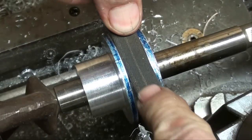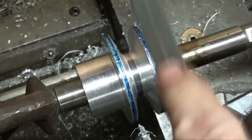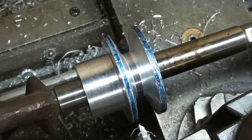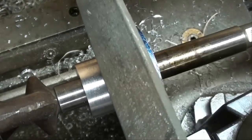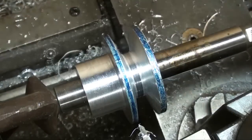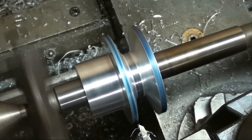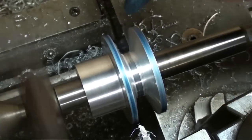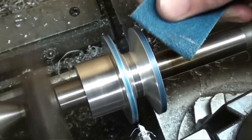It looks like we're right about at a half inch — remember this ruler is a half inch wide and it almost fits in there. Here's a V-belt and you can see that fits in there nicely. Now one final step before I take it out: I'm going to turn the machine on and break the corners, but using a file near the dog is incredibly dangerous, so I'm going to take an abrasive cloth and break all the corners like that.